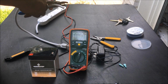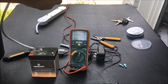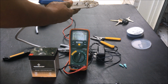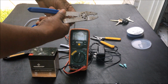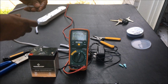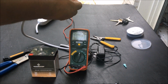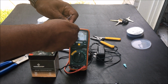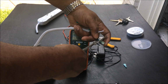Like you see, I'm stripping the plastic coating back. And I'm gonna take my wire strippers, and you see I'm stripping just about, I'd say, 3/8 of an inch to 1/4 of an inch back, or 1/4 to 3/8. I got these connectors right here, and you can get those in the description below also. So I'm gonna put this female connector on, and just take your crimpers and crimp the connection down.